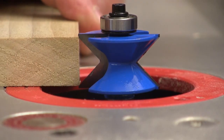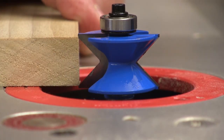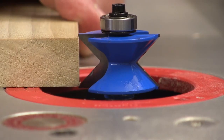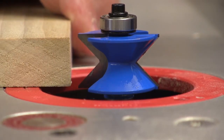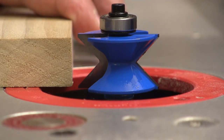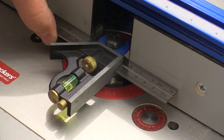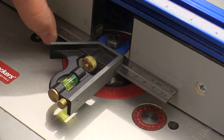These bits are designed to work with wood up to three quarters of an inch thick. When you have the concave bit set at the right height, the upper and lower cutting edges contact the wood at the same time, which makes setting this up very easy. Both bits have guide bearings, so set the router table fence so that both faces are flush with the front edge of the bearing.